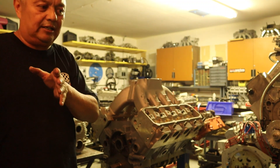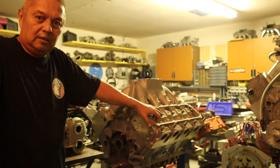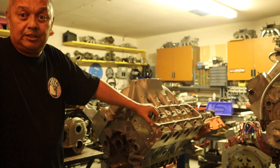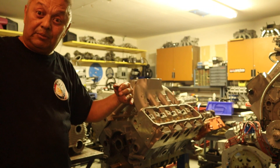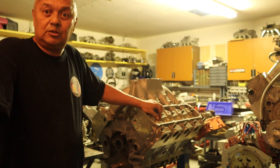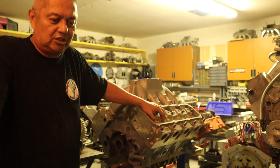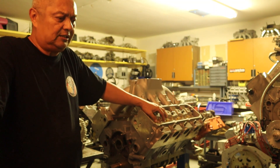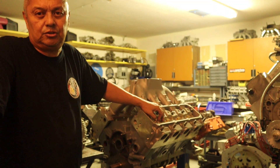It's just like when you look at a valve guide on the head — right behind the guide there's hardly any activity. So there's no intrusion. Some heads I work on are port-injected. One guy from Palmdale had the injector on the long side of the port facing the air flow — air flow coming in and the injector shooting directly in front of it, blasting fuel into place. Very effective, and it does have a tendency to blast the mixture and keep it mixed. Same thing with this Mercedes manifold: fancy, but they wasted a lot. Great idea, very light manifold, wrong execution — injectors in the wrong place.